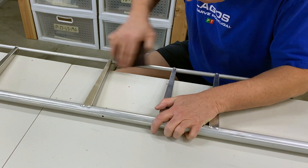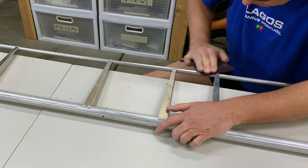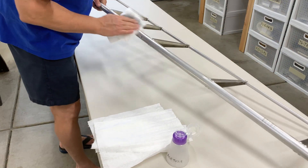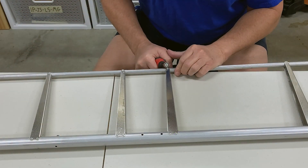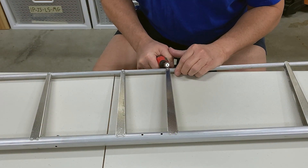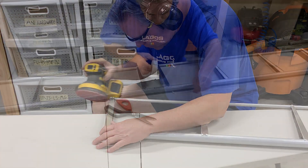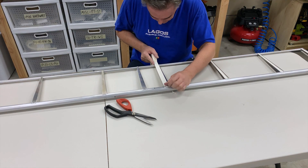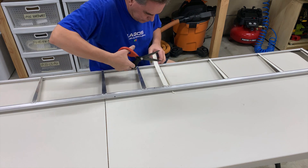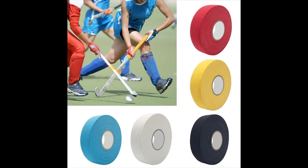Working on a flap here — step one was to rough up the aluminum surface with a Scotch-Brite pad so the Ecobond glue has something to bite onto. Then the residue needs to be cleaned off with acetone, and any sharp protrusions that could tear the fabric, especially from rivet stems, were knocked down with a Dremel or orbital sander. The Rans build manual calls for applying an anti-chafe tape to the sharp edges of each rib, and I learned at the Stewart workshop that hockey stick grip tape works excellent for this. I found multiple widths and colors at my local sporting goods store.